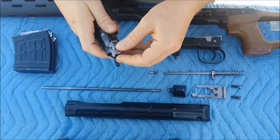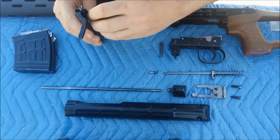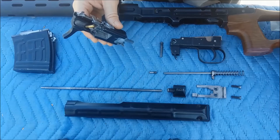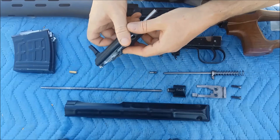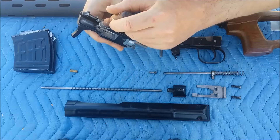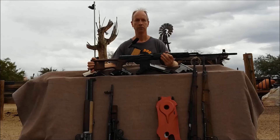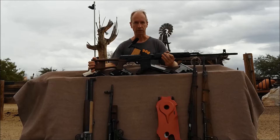Let's get this assembled first. Now with a shell casing here, if I did the same as with that Ruger pistol, the shell casing would just get ejected to the inside of the bolt carrier — it could not leave the action. So the bolt carrier is actually in the way of ejection. The easiest solution would be to just cut an ejection port into the bolt carrier and eject through that, but that's not what I wanted — I wanted to keep the outside of the gun looking like the original.